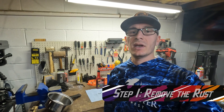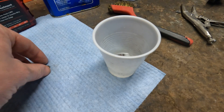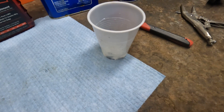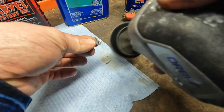The first step is to remove the rust. There are a couple of ways you can do this, and the type of finish you want on the end product is going to determine the method you use. Method one would be taking the part and submerging it in vinegar overnight — it's going to take a while, but it will remove the rust and keep the metal nice and smooth. You can then take a buffing or polishing wheel and polish it off nice and smooth and shiny. The other way is by soda blasting — when you soda blast the part, it's going to create a matte finish.